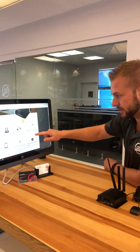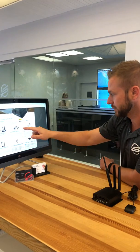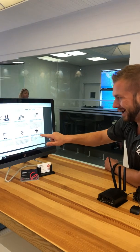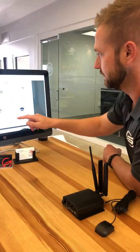We've got redundant SIM card slots. You can create a customized captive portal — so if you want your boat name or cafe name to show up and make people log in through a captive portal, you can do that. I really like the fact that it has a terminal block for secure power, which means it can be wired on to power. You don't have to worry about power cables coming loose for extended industrial deployments like on vessels.